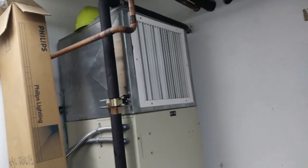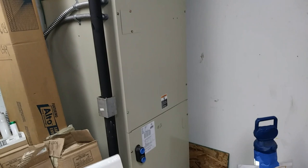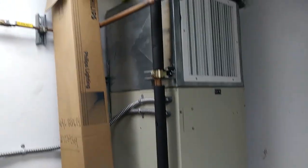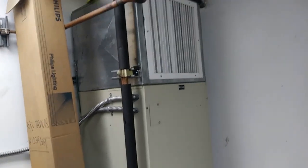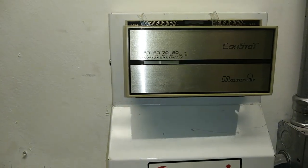It's kind of gone downhill a little bit, but this AC unit is worth talking about. It blows cold — I'm not sure what size orifice they have in there, but it's definitely something more generous than a standard system. I measured it one day and it does like a 40-degree split, which is kind of ridiculous, but nothing's freezing up either. So it's not a TXV — it's definitely an orifice of some kind. We moved the other one of these into the elevator equipment room and it works very nicely for that with no changes made to whatever orifice was in there. There's a lot of heat in that room so it makes a lot more sense there. It keeps it around 76 degrees in there, while this one will get down to 60 in a hurry.